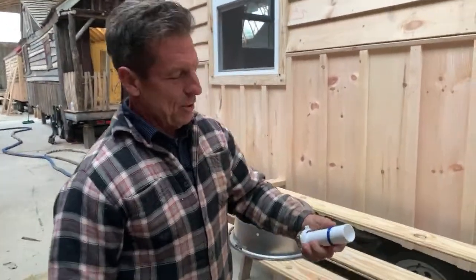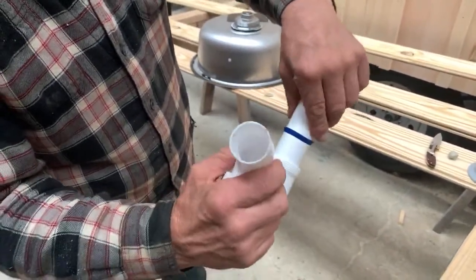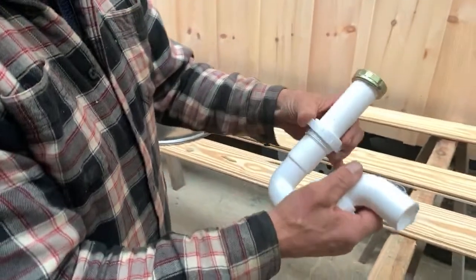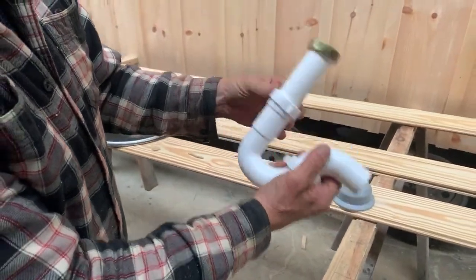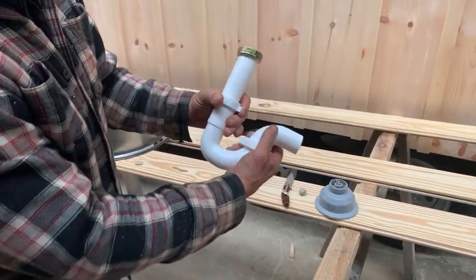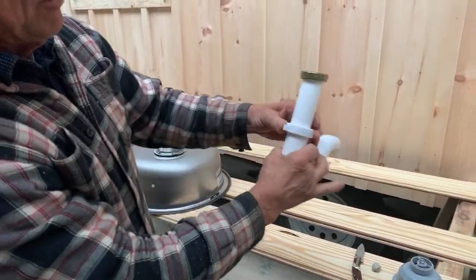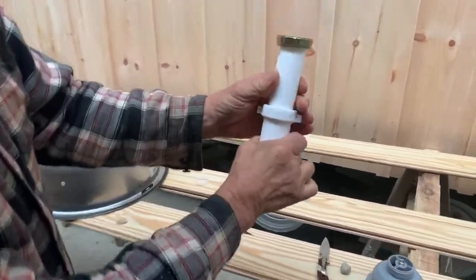Okay, all right, let's finish up with our plumbing. So you put the washer on. It's flat on the top and thin on the bottom. Yes. And that goes inside. That's the tailpiece. You'll screw that down on there. And we lock her down. Now you're back. That goes through the wall. Now the tailpiece, if you loosen that up, it can be adjusted.